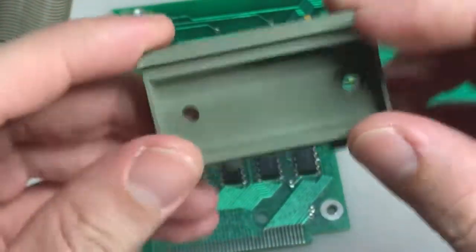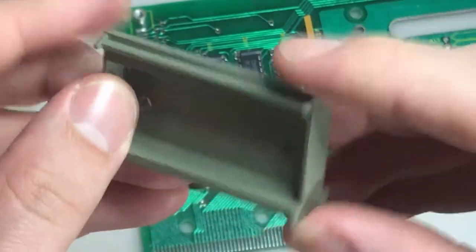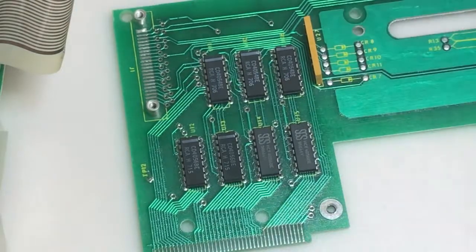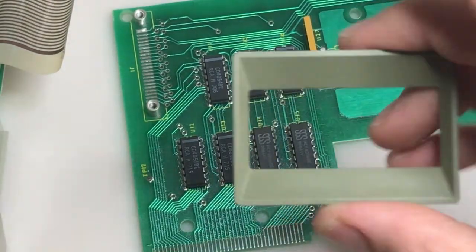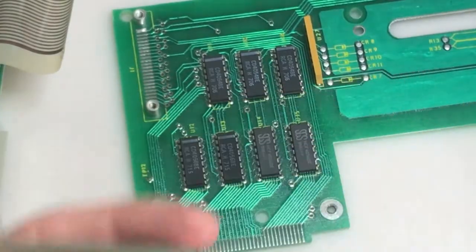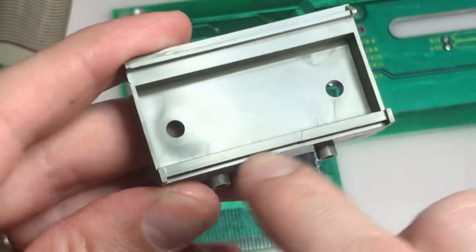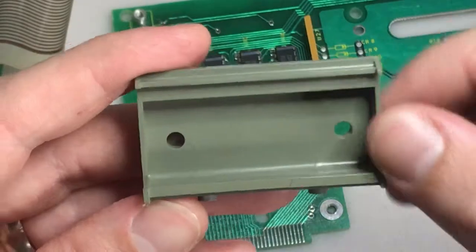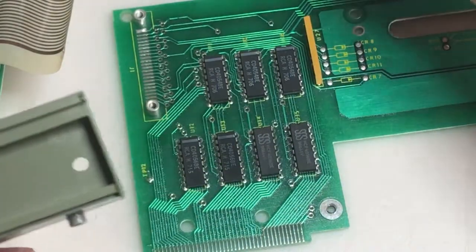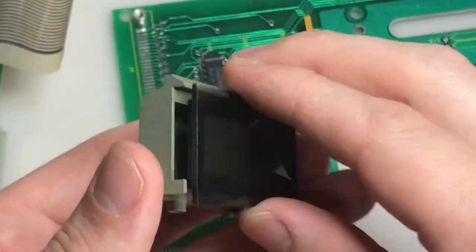So this is our mounting block. This sits. Oh my gosh, look at how bad it is on the bottom. This sits into the board. Our LCD sits flush against here, and this kind of sandwiches the LCD to this, and really your little strip is going to lay right in this little seam here, and the downward force is going to push down and force the strip against the board, and it should also force the LCD against the board like that.